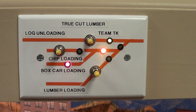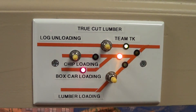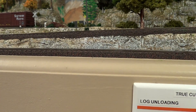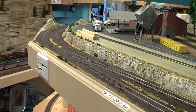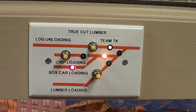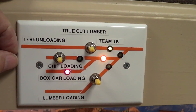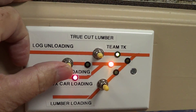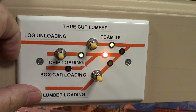Here's an example of a Switch IT with a throw-switch trigger. I have small panels at the top — about 60 inches, eye level for me — because operators can't see the points without a camera at six-foot-five. I put the little panels in like this, with LEDs driven off of Tortoise machines. Be careful: those LEDs are two volts DC — go over the limit and you'll fry them quickly. This is a single-pole double-throw center-off momentary contact switch.